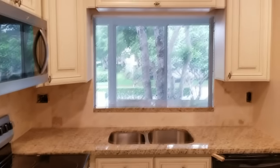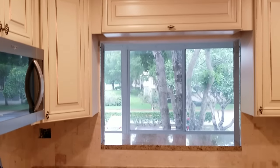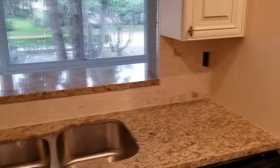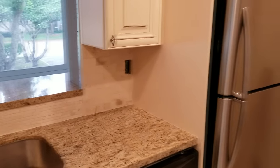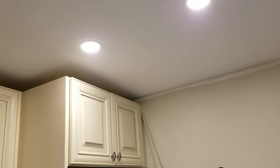You're looking at the nearly completed remodeled kitchen we did — the cabinets we put in, the granite countertops, and the limestone backsplash. I'll show you on my drawing. We did four lights: two over here and two more over here. We always want to make the lights come out 36 inches from the back wall.